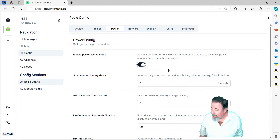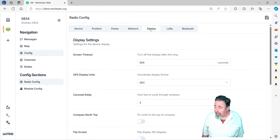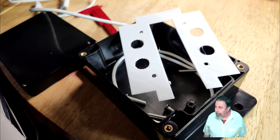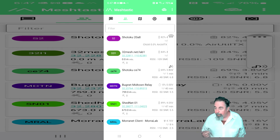I'm exploring the low-power configuration. Basically it'll go to light sleep after 5 minutes. Bluetooth disconnects after 60 seconds, so you're saving that power. Max wake time is 10 seconds — those are all defaults. I also turned the display off after 60 seconds. I figured if you've got the enclosure open, you want to reset it, get your Bluetooth, see what's on the display, connect to it, and change your configuration if necessary. I'm 3D printing a backplane that will hold the Wi-Fi LoRa 32 and the 18650 battery holder, and that'll fit in this enclosure. It's already spent a couple of overnights running just on solar power and the battery, and I wake up in the morning with ample power left. This is very promising — I'll be able to run this using purely solar and the battery.